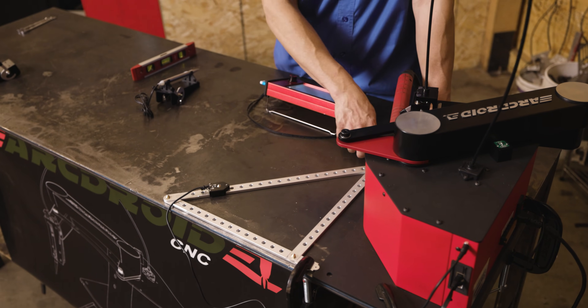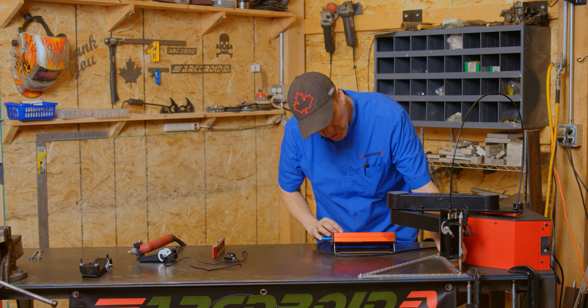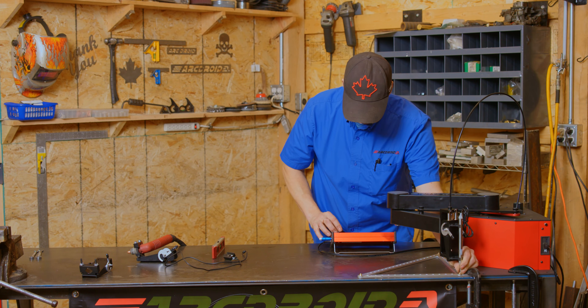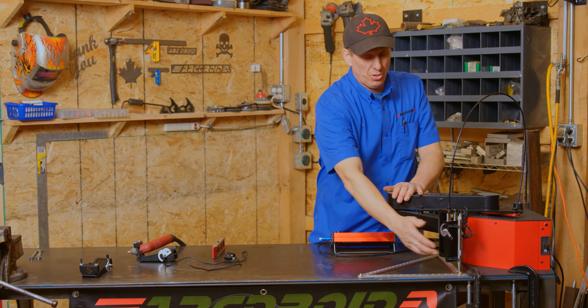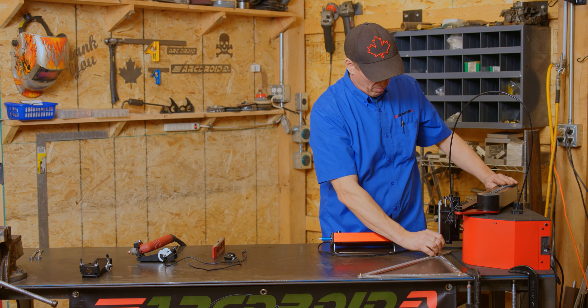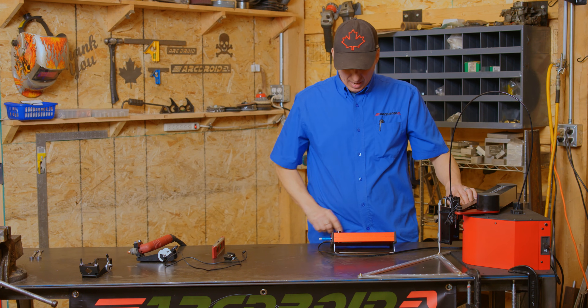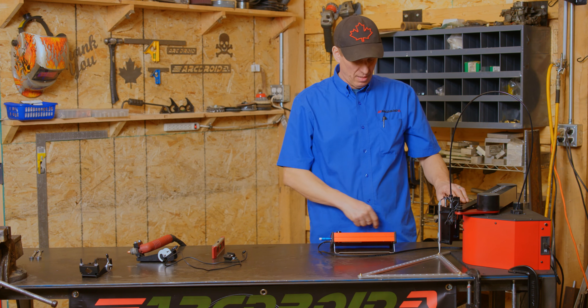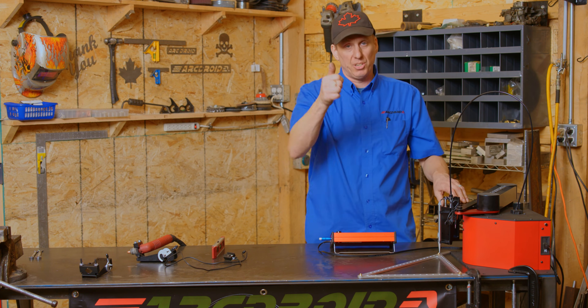Quick and easy way to verify your calibration: the points on this triangle are 313 millimeters apart. Install the stylus, go to the tracing program, choose line draw, go to the first point, lower the stylus down onto the point, zero the screen, and you can either use the button on the stylus or the button on the knob to choose a start point. Move to the other point, lower it down onto the point, and it should draw a line that's 313 millimeters long. If you do that for both of them and they're 90 degrees apart, then you know your calibration has worked.